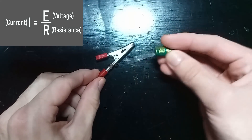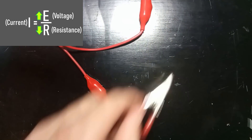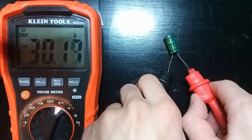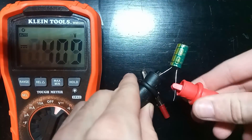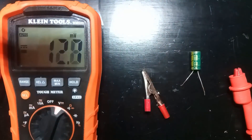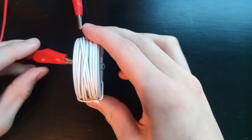Using our equation we have a very low resistance output and a relatively high voltage, which means we get an extremely high amount of current — maybe about 100 amps — through this piece of metal. This only occurs for a split second though, as the capacitor discharges and has no voltage across it, creating no current. This is actually perfectly fine, as the coil should only be powered for a quick second to accelerate the projectile anyways, otherwise the projectile gets stuck in the center of the coil.